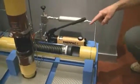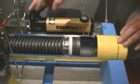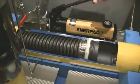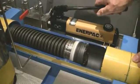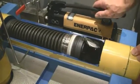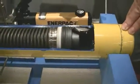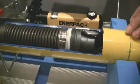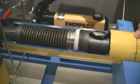Let me demonstrate the hydraulic opening of this small tool alongside — it's very similar. Here you see a spring and here the flapper. Watch now as I pump and apply hydraulic pressure. The flapper is beginning to open. Observe the sleeve coming behind it — that sleeve is going to isolate the flapper from the flow to save it from damage. The spring is being compressed and now has a lot of energy contained in it.